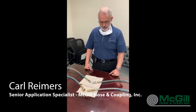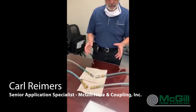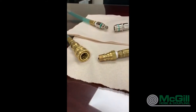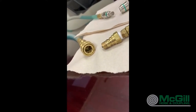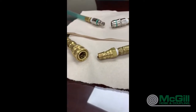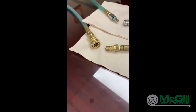The purpose of this video is to illustrate two types of quick disconnects available in the market today. The first one is what they call an ISO-B — it's probably the most common. It's got valved sides on both the female and the male half. Available in brass, steel, and stainless steel from eighth inch size all the way up to two inch.